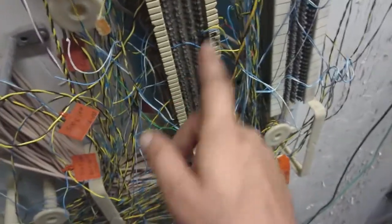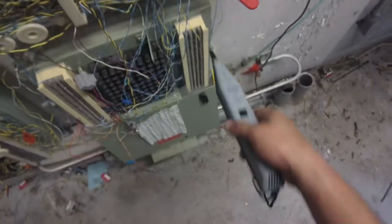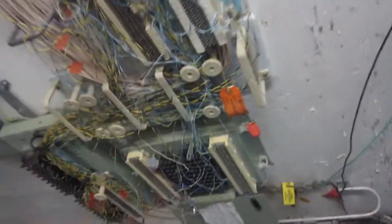But the toner's up there. You heard it. Ding, ding, ding, ding, ding. On there, I want to see if it's going down that wire. So it is going down that wire. So we got continuity or a good connection. Just using a flathead screwdriver instead of going all the way back to get my punch tool, which I forgot. But she's hooked up. The old one's been pulled off, and that's what we're gonna do. Yee-hee!